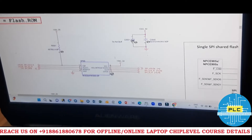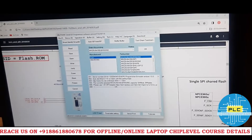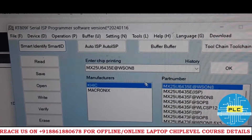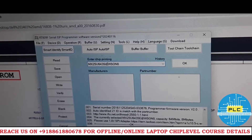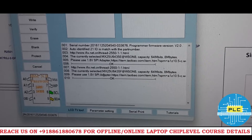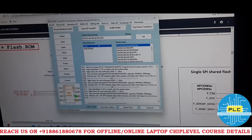Connected. I'll open the software. It's open now. As I mentioned previously: if 'F' appears in the chip name it's 1.8V, and if 'E' appears in MX chips it's 3.3V. I'm entering 'F' — it shows 'Please use 1.8V adapter.' So I'll use auto-detection instead. In auto it's detected as 'E', which means 3.3V.